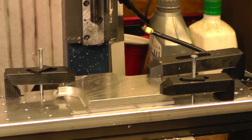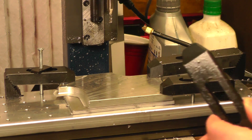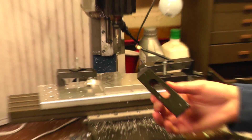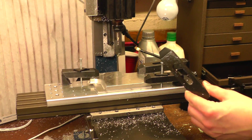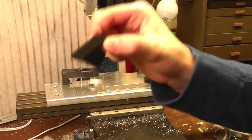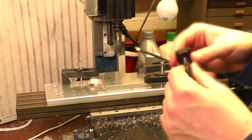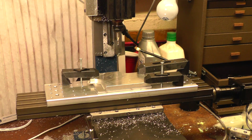This is the tooling kit I may or may not have talked about so far. There are standard kits you can buy from the likes of Grizzly and Shars — it's all basically from the same factory in China. They consist of a hold-down block, these little ramp-looking things, T-slot nuts, screws that you put into the T-slot, and then nuts for the top.